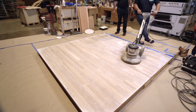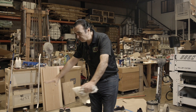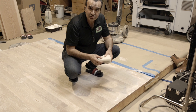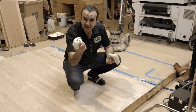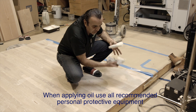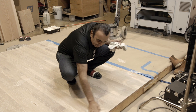See how beautiful the ceruse effect is coming out. I took most of the excess off from the middle, but on the perimeter where the buffer can't reach, I still have some excess oil. What I want to do is remove it with a towel — pull the excess off and then hit it with the white pad, because that's what I'm going to use to finish everything eventually.